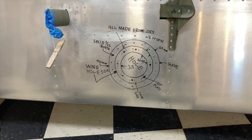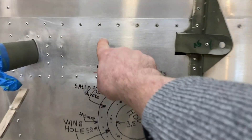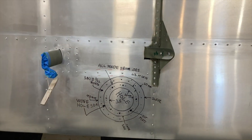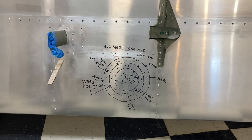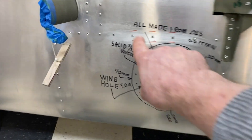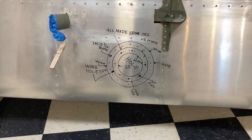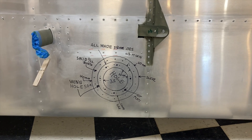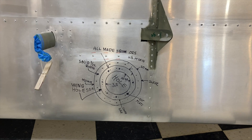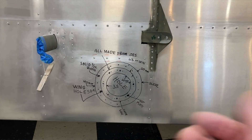The first thing I did was consider the design. I have a cross member support in here. I thought about just cutting a square panel, but the problem with that is I can't get a wrench very easily on the back side of the nuts and bolts down there. I also have a support across here that was put in to reinforce the structure. Once I cut this hole I've got to be able to reach up in and put two end wrenches in there, hopefully even a torque wrench.